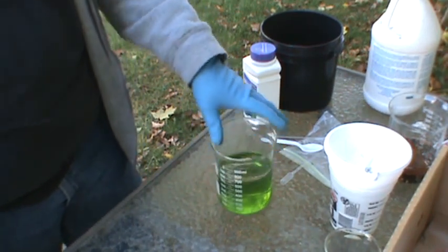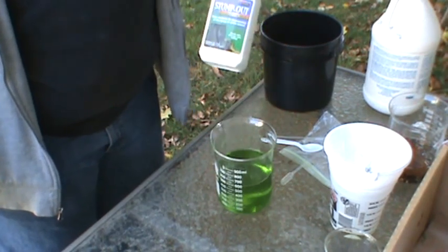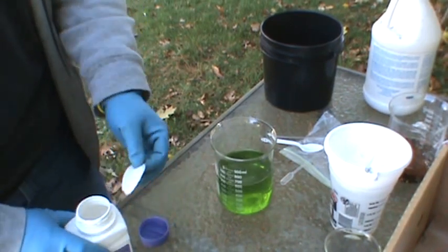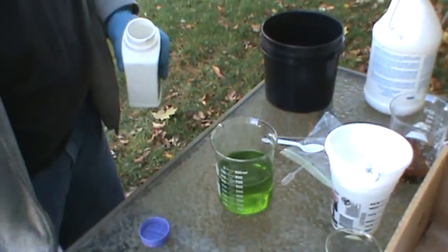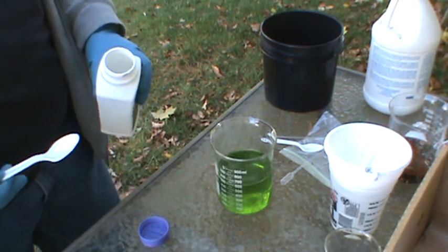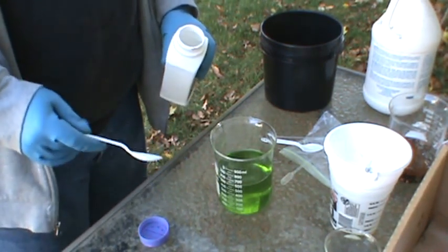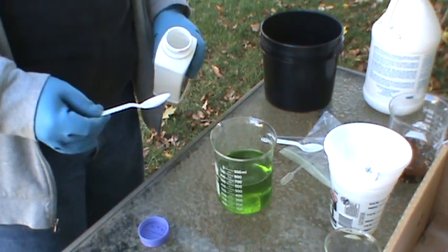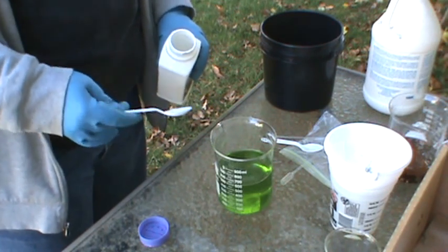What you're going to need is your auric chloride solution and sodium metabisulfite, or bonide stump out. The reaction is very fast and I'm not going to need a whole lot. There's a formula to figure it out, but when you're recovering from e-waste it's hard to tell exactly how much gold is in there. So it's best to just add the sodium metabisulfite and test the solution when it starts to separate, to see if there's still gold in the solution with stannous chloride.